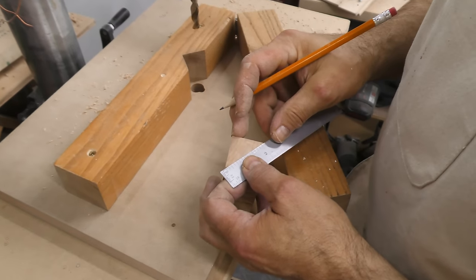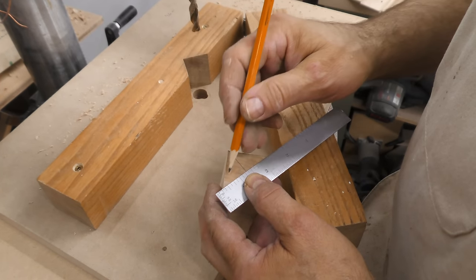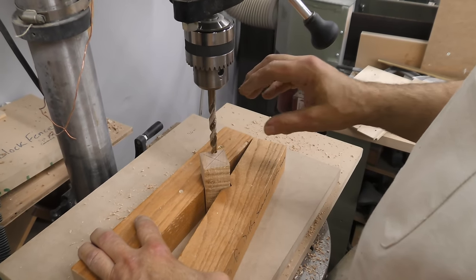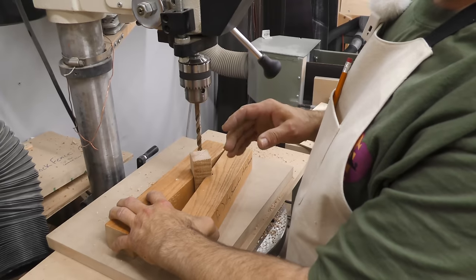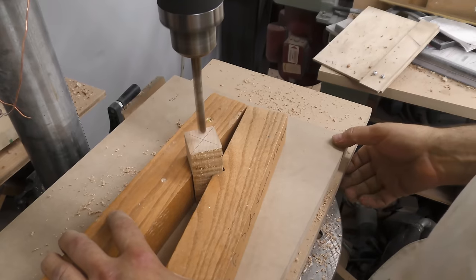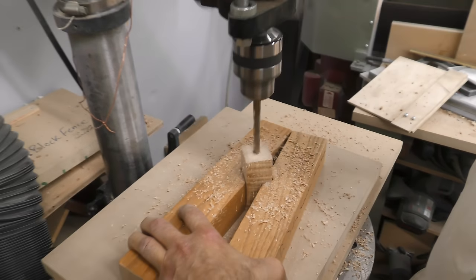Okay, first thing I need to do is find my center mark and the easiest way to do that is just draw a line between opposite corners. Now I've got a little jig that I use for drilling square stock round, so I'll put that in there. The bit I'm using is a 9.6mm. The connecting rod is exactly three-eighths of an inch — 0.375. The problem is most three-eighths drill bits are slightly under so it makes it too tight. We found that a 9.6mm gives you exactly what you need — just enough clearance to get that down. I normally would clamp this down if I was going to do a lot of these, but since I'm only doing one — get that right on the center, allow for chip clearance, and ear protection.